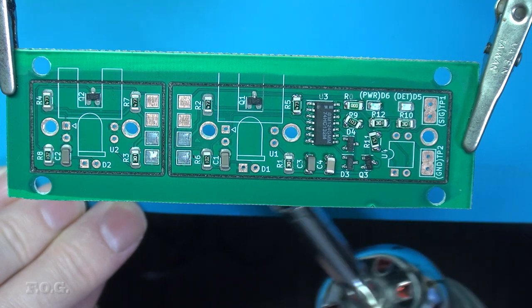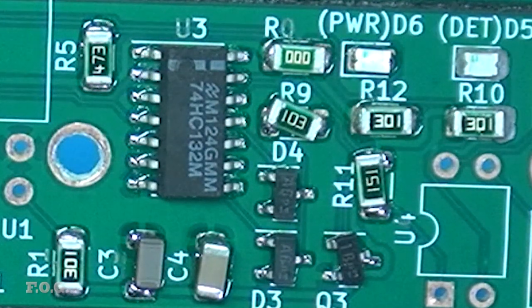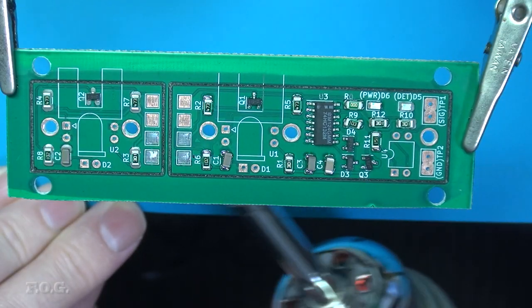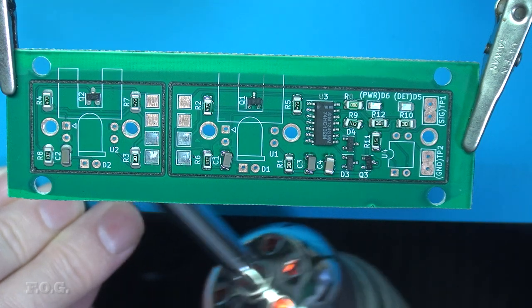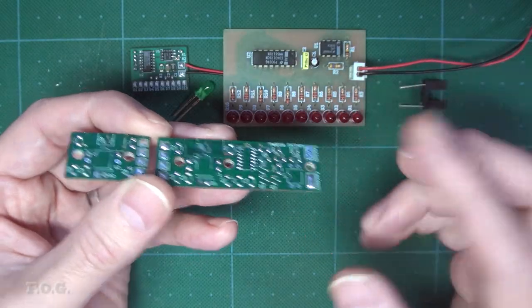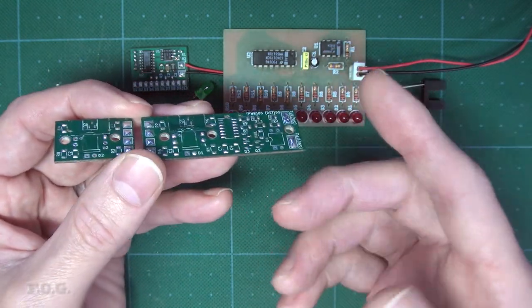I also noticed that some types of components, such as capacitors and LEDs, floated off a bit under the surface tension of the solder as the solder paste would actually melt. Now, I found some special and pretty expensive heat-activated glue intended for surface mount components, so I'm planning to give that a go at some point in the future. In any case, all of these problems discussed so far are really not all that critical, a little bit annoying, but easy enough to work through.